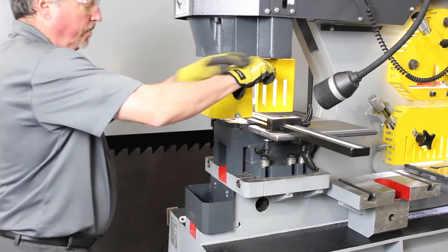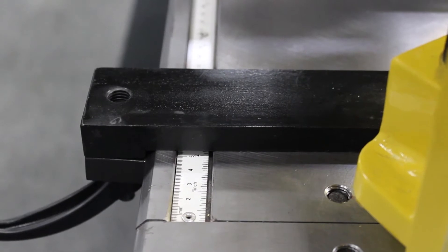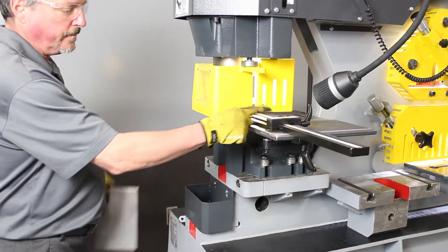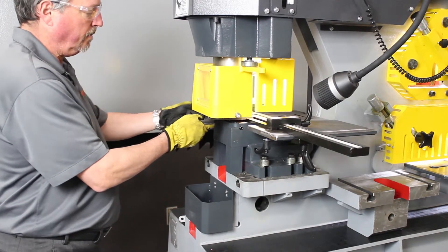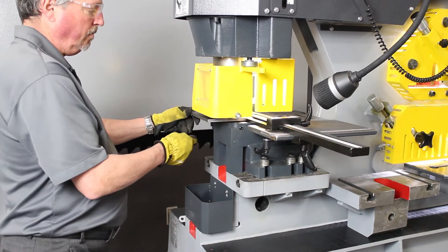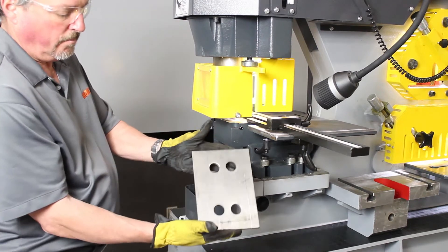You can close your stripper and your punching operation can begin. You get a gauging bar to go on your gauging table, which gives you an XY axis to position material for repetitive punching. When punching the corners of the plate, you can use your gauging bar to do multiple hole punching quickly and accurately. We have the hole set for two inches in and two inches over, which is good for base plates as well as other punching operations. You can see the even spacing.